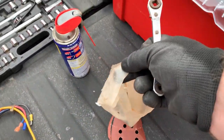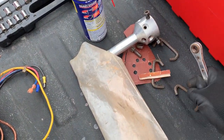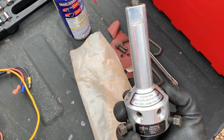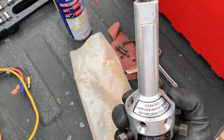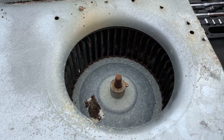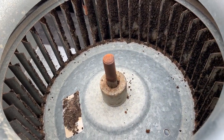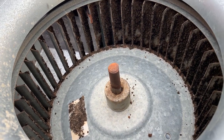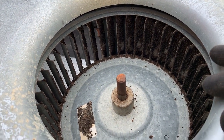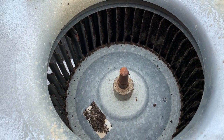I did have to come back to the shop for my puller. It actually does have some sandpaper in it too — planning ahead. This is the Sensible Products puller, made in Chicago. The instructions say: clean and lubricate motor shaft before using puller. That's the plan. It's been on here for 20 years. It's a good sign when it slides down right off the bat — that means I'll probably have an okay time getting it off. In fact, once I clean it up, it may just slide off. I'm going to sand it up a little bit, get some of that rust off, and I'll go ahead and get the screws off the bottom so it can plop out.